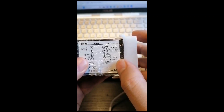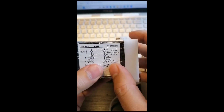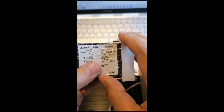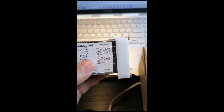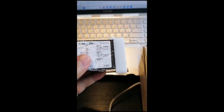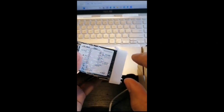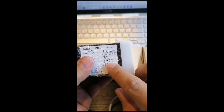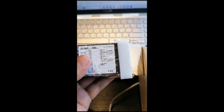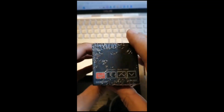Always remember, this controller has a 5 ampere resistive load. It's going up to 1000 watts. However, mostly our clients use an external relay to trigger bigger relays. Small relays will protect your controller. That small external relay is going to trigger a contactor, which is going to hold a large amount of current. For example, if you want to control motors, you cannot directly connect them from here. This controller will just serve as a switch mechanism to your small relay, which is going to trigger bigger relays, like contactors. That is the use of this temperature controller.